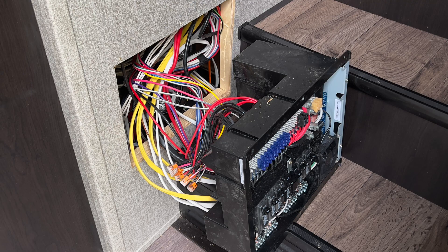I would splice those new cables in here and connect them directly to the charge controller down in the battery bay. That meant figuring out how to get the wires down this wall through the rest of the trailer. That ended up being pretty simple because at the bottom of the wall is the breaker box with fuses and the shore power charge controller. Everything was right there — I just ran the new wires down there and snaked them through to the battery bay on the other end. It wasn't that challenging.